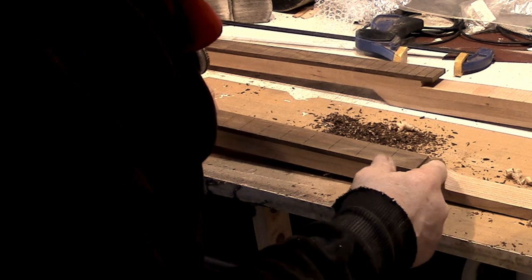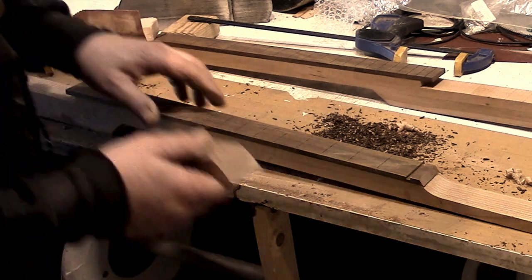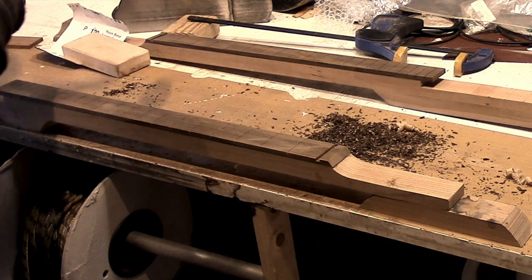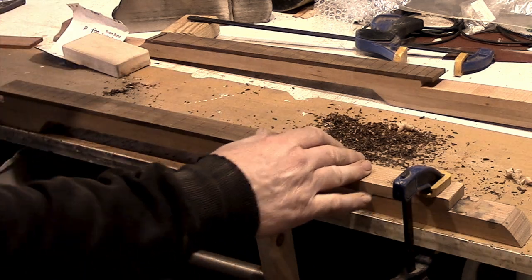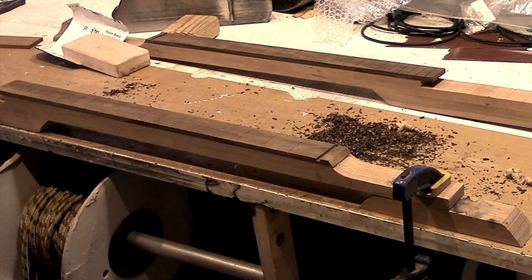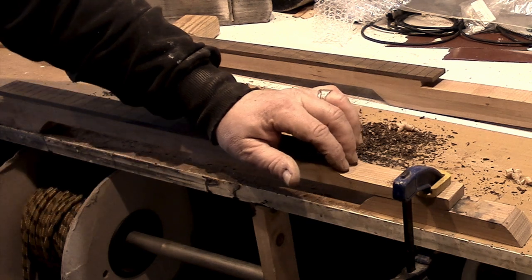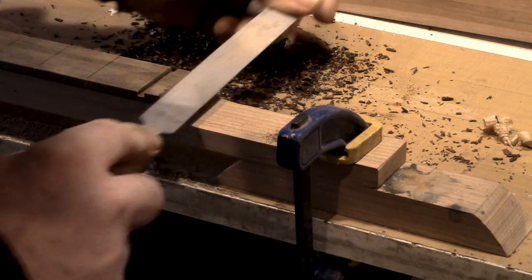The only thing left to do now is to finish this — there's still a little bit of a lip. So what we can do is file and sand that off. I'm going to put a block under there to support it. When I clamp a neck down I don't want to be twisting it or inducing any force. With a packer the same thickness as the heel, I just want to get in with something like a half-round file to smooth this transition out here.